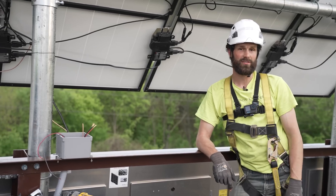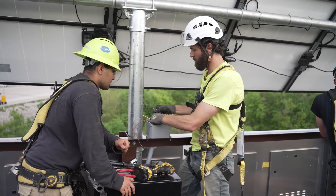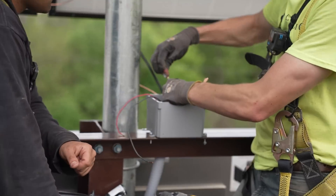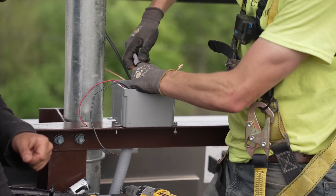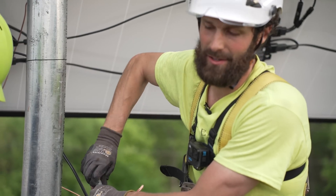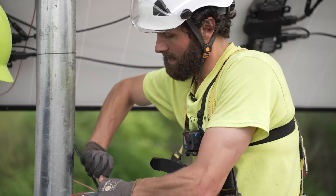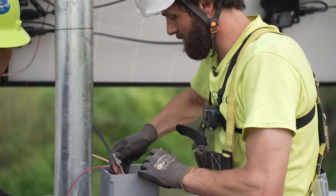It's time to make up our connections. We're going to use a wire nut on the ground because that's not going to carry any current. We don't use wire nuts on DC terminations — wire nuts are just not rated for DC, or at least there's a high failure rate when wire nuts carry continuous DC current. So there's our grounding connection.